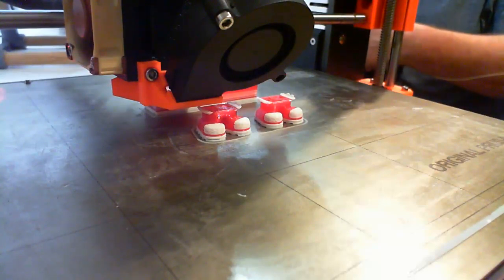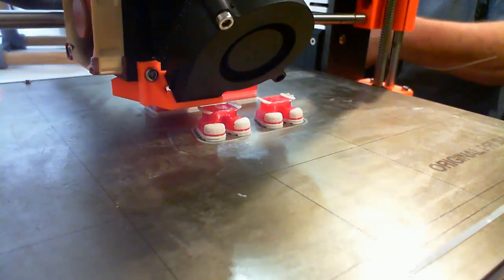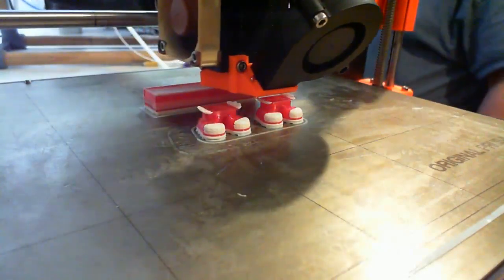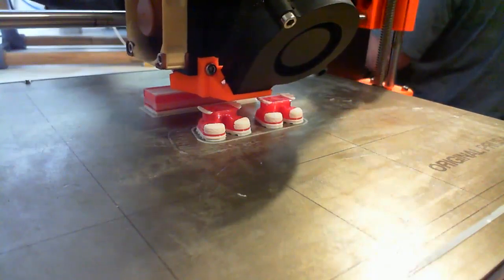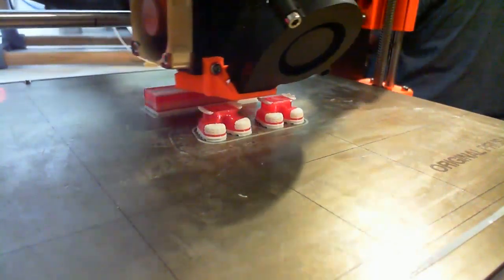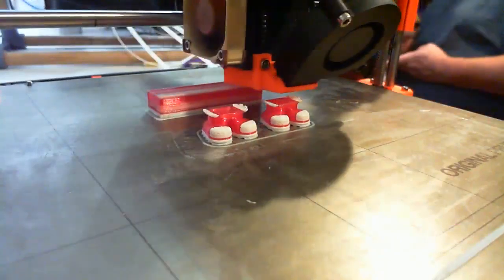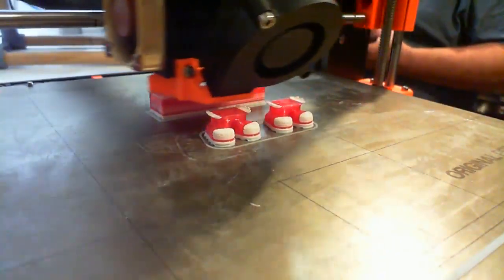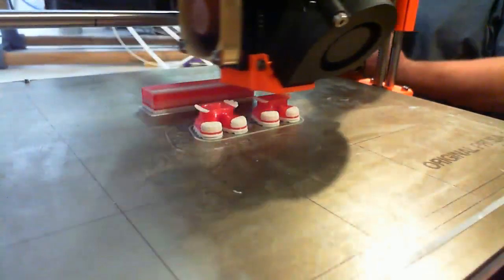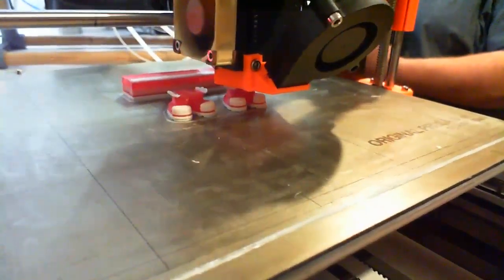I mean, having that little ceramic heater thing at the end, it was stainless steel, so it was a hardened nozzle. That was cool. But they tried to super microsize everything on the printer, and they should have just made the head bigger. I understand why they didn't, because it was already running into the frame. But yeah, a lot of bad design decisions in that one. Yeah, and so slow. I had my Micro printing at 40 millimeters a second, but I was using that alternate firmware.